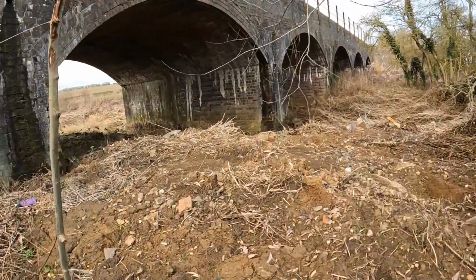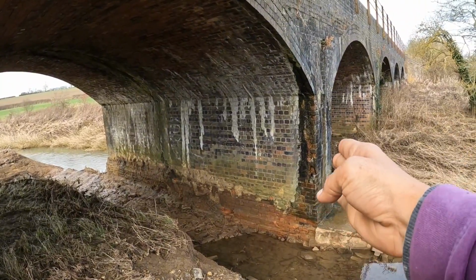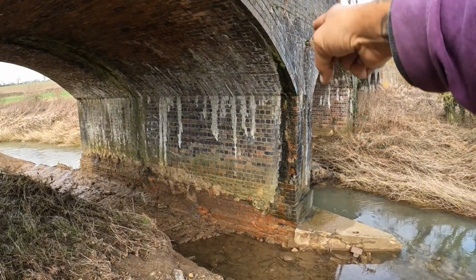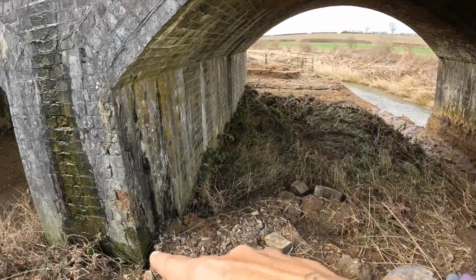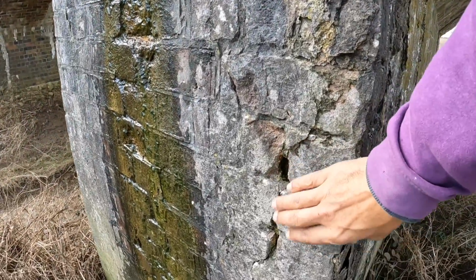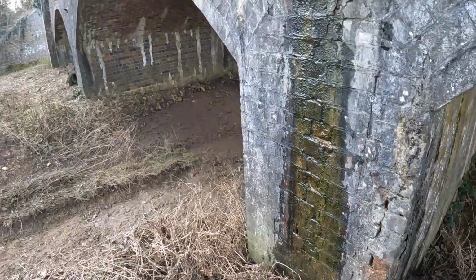Oh, sorry, Mr. Farmer. This is quite important work here. Oh, look. That's the worry one. You see on the edge there where it's all wet, so it's draining off the bridge, coming out that middle pipe and soaking that whole wall, and it's leaving it all crumbly. Look, that one there is going to need the most amount of work doing to it. You see, it's here as well, look. So it comes out this pipe and it wets the wall, and then this gets frosted and starts breaking off. That isn't too good there. I mean, look, I don't do too much, but at least they know.